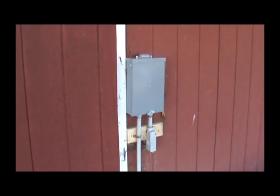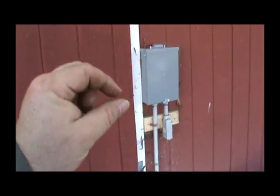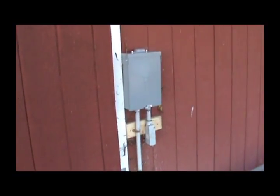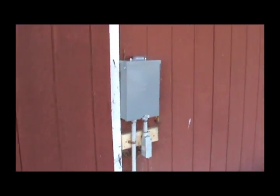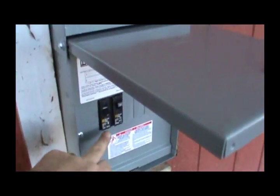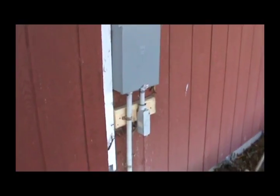What a pain — right now I've only got lights hooked up, because the narrow 15-amp GE breakers from the old box don't work with this new Square D panel. The Square D fit the old box but the GE breakers are too narrow for the Square D box, so I'm going to have to get two more breakers. I went ahead and put the 30-amp in for my air compressor, but I still need some 12-2 to run a new lead down.